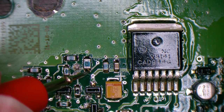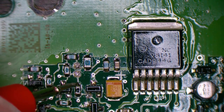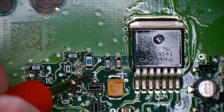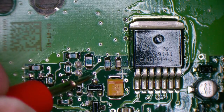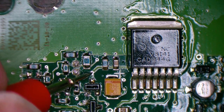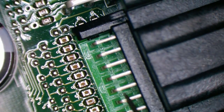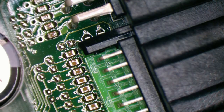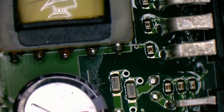And it goes through, we've got a resistor to ground, another resistor in series, another one in series, which comes down through a jumper, which goes to the base of this transistor, which then feeds our enable pin. There we go. Proof of that. So that's how we know that the pin we were checking, because basically all these pins along the back of the connector, you just run across them while probing the other end and try and figure it out. And eventually, you figure out which one you need to feed 12 volts into.